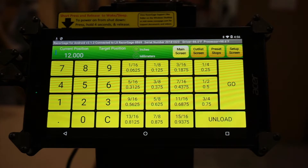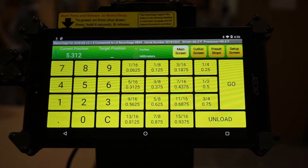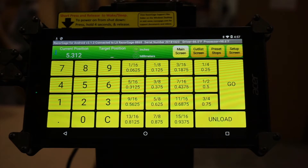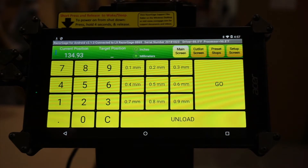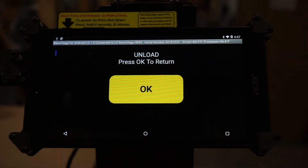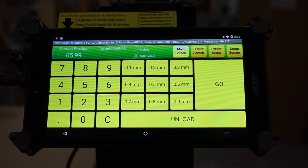If your next part was 5 and 5/16ths, you just punch in 5 and 5/16ths. You can see there are quick set keys for fractions, and the decimals are right underneath of them, depending on how your prints are drawn. Another thing on the main screen is you can jump from inches to millimeters — simply push that button and your screen changes immediately into millimeters. Everything works the same. The unload is a preset distance. We just pushed unload, it moved back out of the way, then it moved back into the position where we're going to make the cut, and you're ready to go.